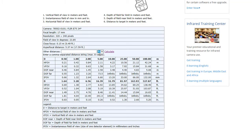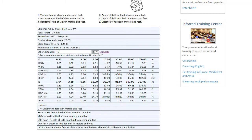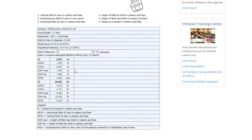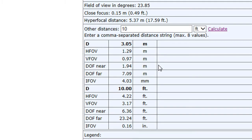Under the 'Other Distances' field, select what units you would like to use. We'll pick feet for this demonstration, but the output will also include metric equivalents. Let's try it at 10 feet and see what we get — type in the value and select calculate. For this configuration, the FLIR E75, which is a 320x240 focal plane array with a 24-degree lens, standing at 10 feet away, my HFOV or horizontal field of view is 4.22 feet. That's how far across I'm seeing displayed in my field of view, or what's essentially on my screen. The VFOV or vertical field of view is 3.17 feet. It's the IFOV, however — the instantaneous field of view — which is the resolution value we are seeking.